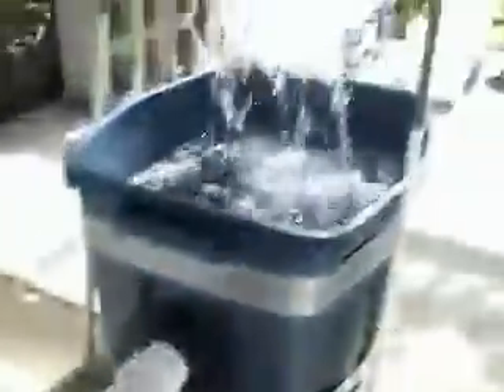You're going to see the pump run at full blast. That's a little heavy for this angle — it's probably at about 18 degrees or so right now. Let's take a look at how that two-inch pipe handles the draw from the pump, keeping both reservoirs about equal. If you were to go over 2,500 gallons an hour, I would recommend a two-and-a-half or three-inch pipe system to connect your reservoirs.